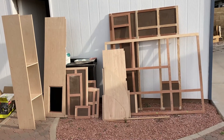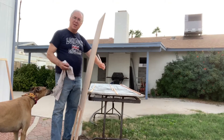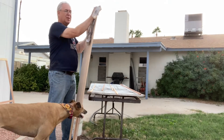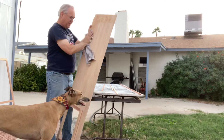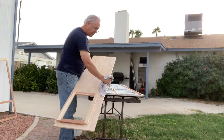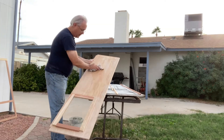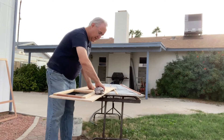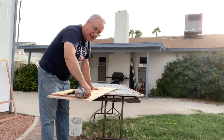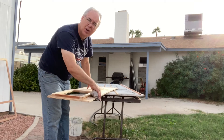We're going to start with the big surfaces and rolling. We've set up our table with little sticks to keep our pieces up off the table. Now we're just going to wipe down each piece as we go to get all of the sand dust off — we have damp rags, not soaking wet, just damp — that way we can pick up any of the sanding fuzzies and hopefully not have that in our paint. We will be doing a very light sanding after this initial primer so we can have a nice clean surface before putting our actual color on.